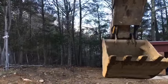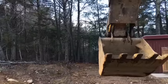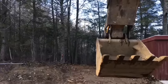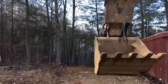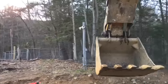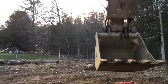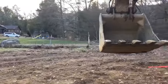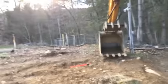You guys will see today — this is a pretty big machine, a 210. You can rent a mini excavator though and you can do a ton of work with it. Generally you can rent one for around 600 bucks for a week. If you line up a big project — doing some fencing, maybe putting in water lines — that pole right there has water and electric. We put that whole line from there all the way over to the house with a mini excavator. Great tool. I really suggest using the mini for a lot of earthworks — they're pretty easy to learn and run.